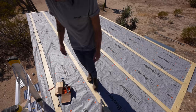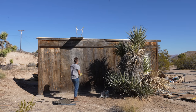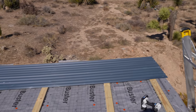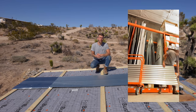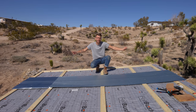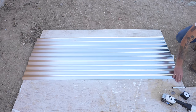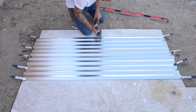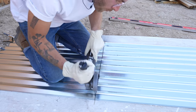At this point in the project, I was excited. The old roof was completely covered and it was time to see how this sheet metal lined up. These are the galvanized corrugated metal panels that I'll be putting onto the roof — super waterproof and they'll reflect a lot of this Joshua Tree sun. I picked these up from my local Home Depot, and one 10-foot and one 3-foot section fit this roof perfectly with an inch and a half overhang on each eave. I made the 3-foot panels by cutting 6-foot pieces in half, which was really easy to do by spring clamping all of my pieces together so I could batch cut all of them with my angle grinder. 29 gauge metal is 0.013 inches thick, so cutting through 7 or 8 of these panels was not very difficult at all.